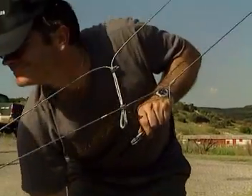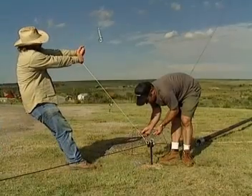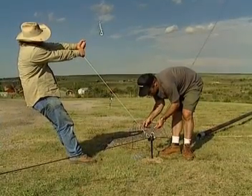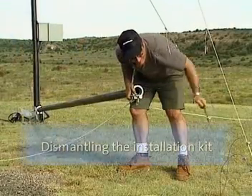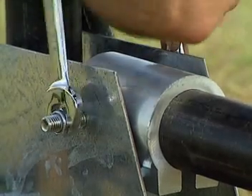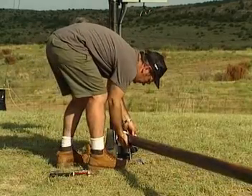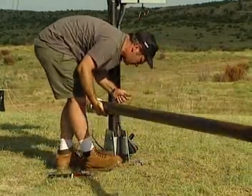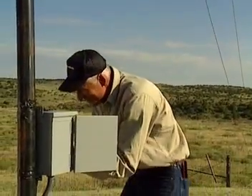Adjust all the wires and make sure that the tower is in a vertical position as seen from all four sides. Remove the towing wires and dismantle the gin pole. One by one, connect the three wires from the power cable to the breaker box. Finally, release the turbine with the disconnect switch.